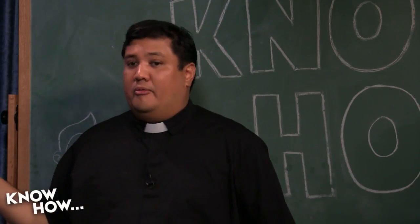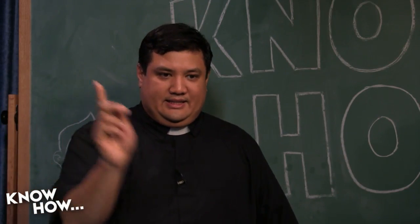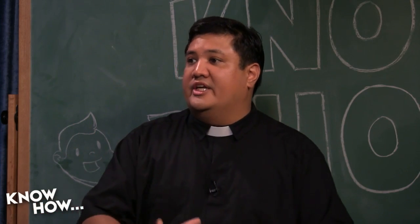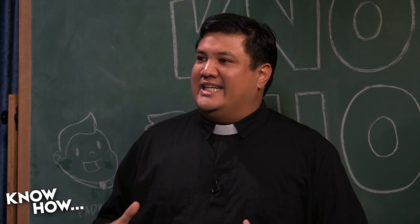Way no problem. But that's not it. We're going to talk a little bit about why we scale up the equipment and how we actually buy what we need for a particular space. This is important because at the height of our grow, no matter what you might be growing, you have to assume that at some point you're going to want to exchange the air once every minute.